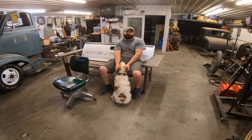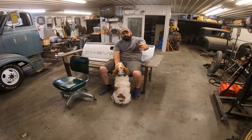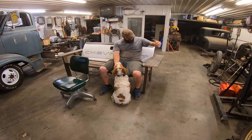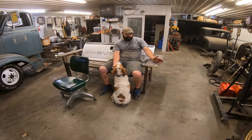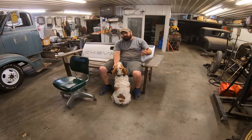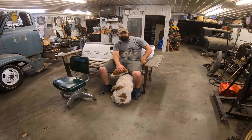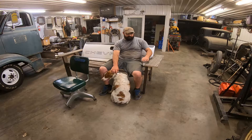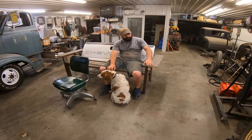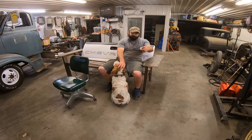Now you know I hate tailgate benches, and if you're gonna build one, do something like this — don't build your plain-Jane vertical-upright back with a level base. Ergonomics, kids. Inch-and-five-eighths torx screws for the armrest and three-inch for the rest — two-and-a-half would probably be ideal, but three inches is what I had. I did trim a couple off because they were going to stab somebody — you don't want that, keep it safe. If you really want to get crazy, you could drill in a couple of cup holders or radius the edges.